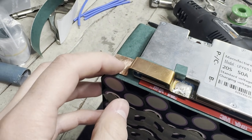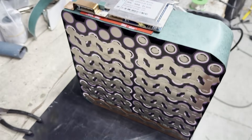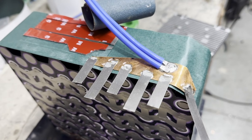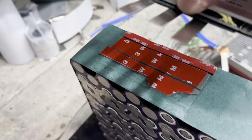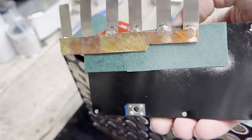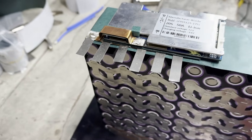I thought this would be the perfect way to do it since I only have that little solder joint there. But I can't get the cells to do a copper-nickel sandwich anymore — it's gotten cooler since I did the bottom. So I'm just going to add some nickel going up to a big piece of copper on the top. On the BMS side, I have six pieces of nickel going up to a piece of copper on the bottom, soldered to the copper that goes over the top. That'll sit right here on top, and I can bend the nickel over and spot weld it to the cells.